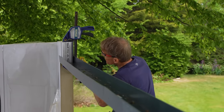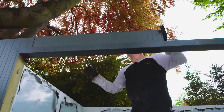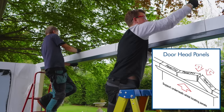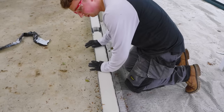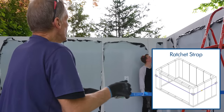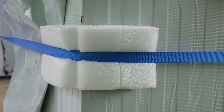The beams are pre-drilled, but you need to continue through with the drill to place the pop rivets. These short infills over the head of the door need to be lowered in — if in doubt, check the instructions and keep checking them, that's the golden rule. This ratchet strap will bring the whole building really tightly together — just ratchet it up, but don't forget to protect those corners with some foam.